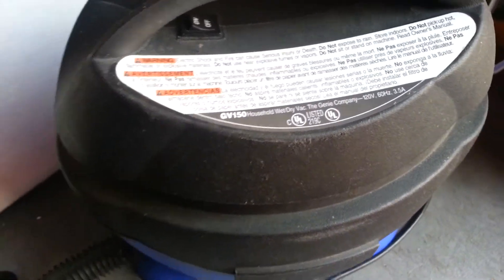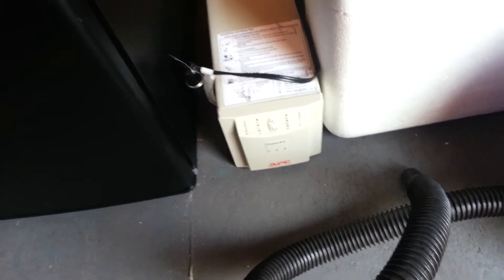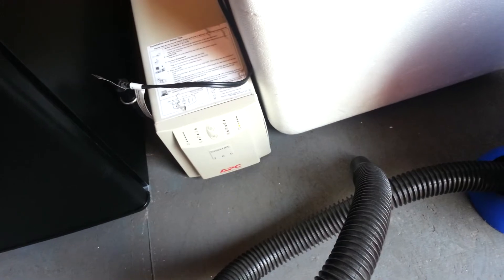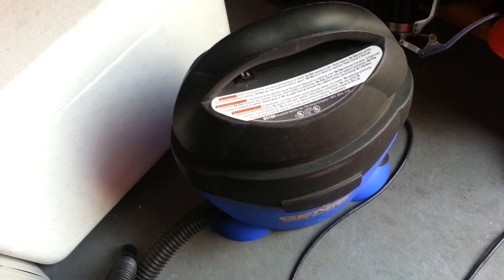So if you're wondering if you can do solar and what you can run off it, there's my proof of concept. 420 watts running off a 450 watt APC inverter, and the neat thing about it is that it handled it very well. Sometimes inverters are rated for a certain wattage but really don't run at that wattage — it's much lower. But in this case, very impressive with the APC Smart UPS. So there you have it from the solar shed — an update from Anthony. Don't forget to comment and subscribe. Thanks for watching, guys.